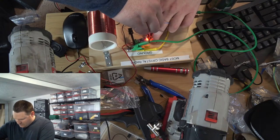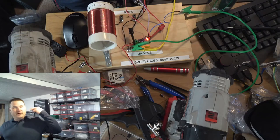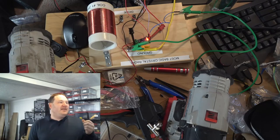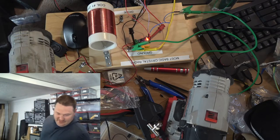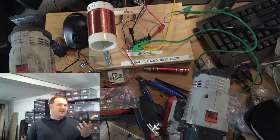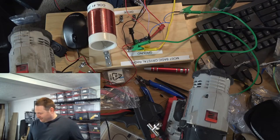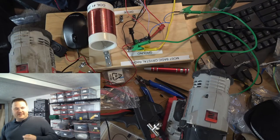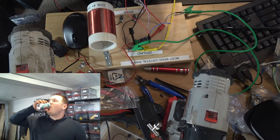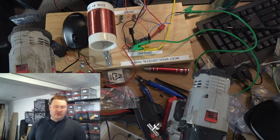So that's the crystal radio. We're getting audio off the aerial, and I was kind of surprised that this was music. I'm going to turn the speaker off so we can cut the noise there, but it's music. I was expecting talk radio. My local AM station that's the strongest happens to be a sister station of an FM station, and they just simulcast it. So I'm getting their FM broadcast on the AM side. And that station's somewhere up around 1500 kilohertz.